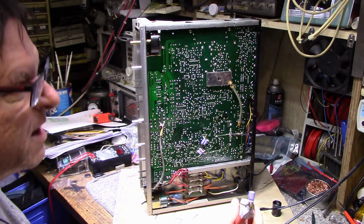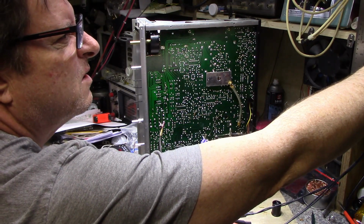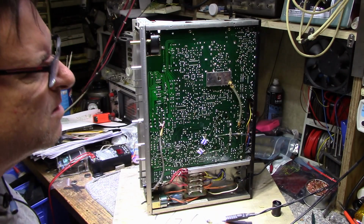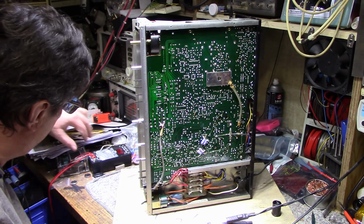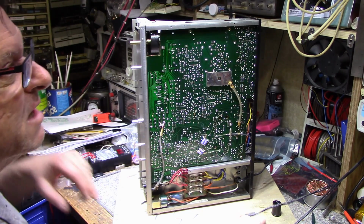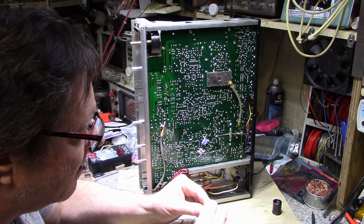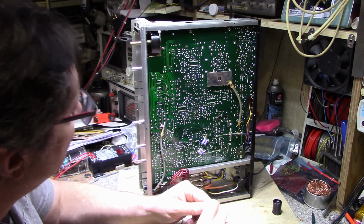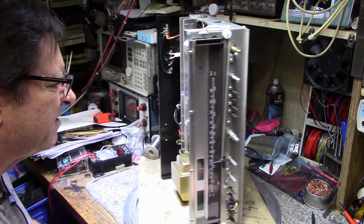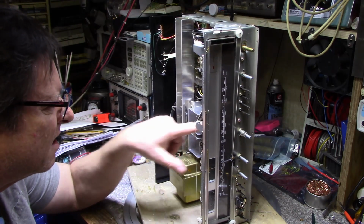So this is a 220 at 16, and I have it at 184 microfarads, and my ESR is at 266 milliohms. It is probably within spec, but it's leaking, so that's a bad cap right there. It's leaking. And I'm wondering how many more of these I'm going to find that are leaking. And that is in the tuner circuit, I think.